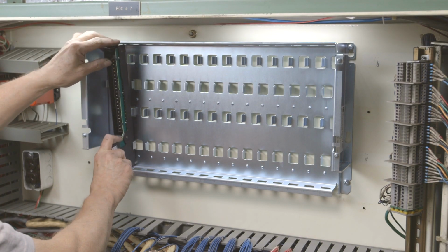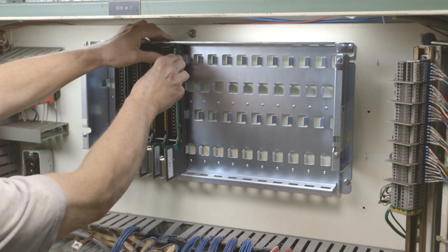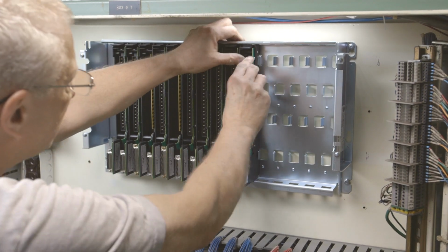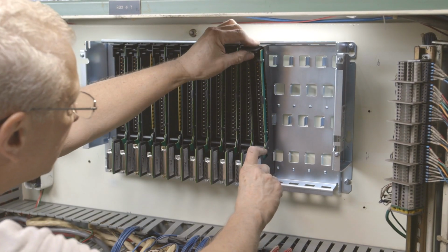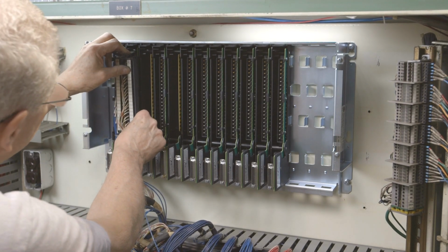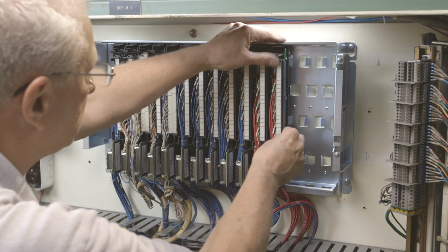I/O conversion modules are snapped into the base plate. These 25 or 37 pin modules transition the PLC5 I/O wiring to ControlLogix using the PLC5 headers we draped below earlier. Rockwell's selection guide will help you determine these part numbers. Now we reinstall the PLC5 headers in the order as they were marked.